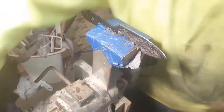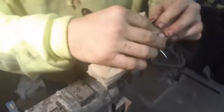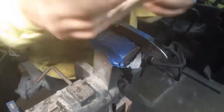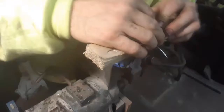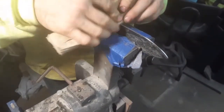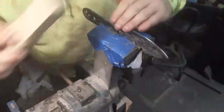Now what you want to do is clean it before you put it into tempering. Get a nice exposed part of the edge — that way you can see the colors during tempering. Get one of those little handheld laser devices that you shoot and it tells you how hot something is. Between that and seeing the colors, you're not going to overheat it on tempering.